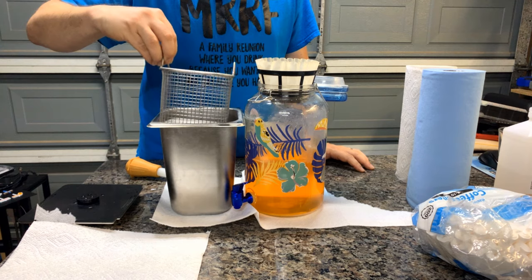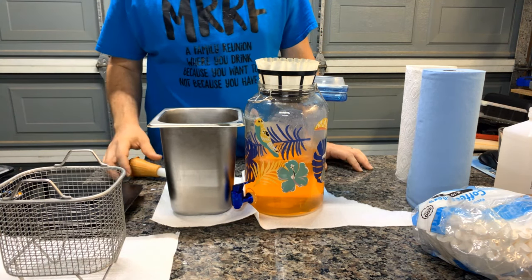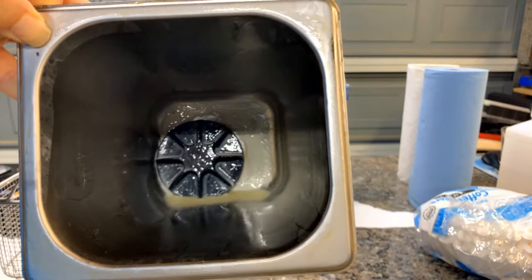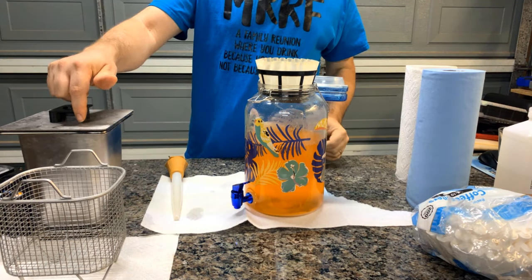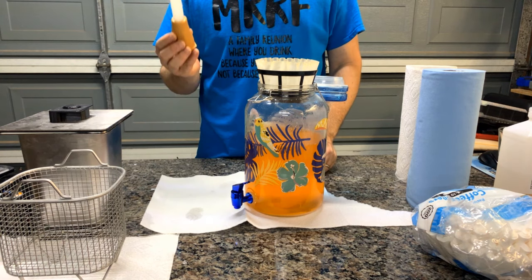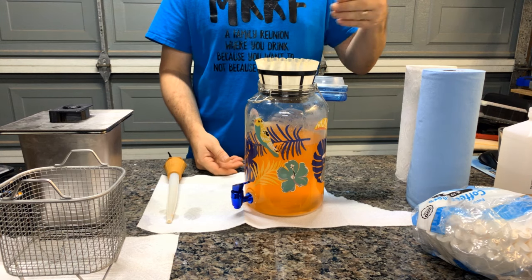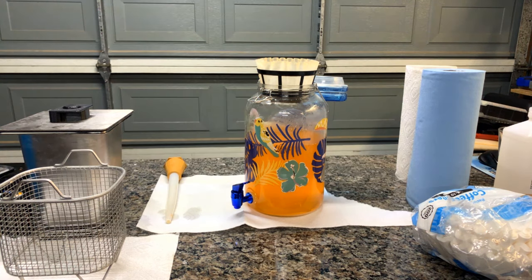I'm going to pull the basket out of here and set that aside. You can see some of the white buildup on there where it's exposed, and we're going to scrub that out and clean it later. Most of the sediment is here at the bottom. You can see the bottom of that pan — that milkiness — that is what settles to the bottom of the IPA after you've done prints for a while. We're going to take this pan and wash it, then close this up and leave it in the sun for a day or so. Once it's been in the sun, that same white powder will start to congeal and settle along the bottom. At that point we'll repeat the exact same process with the turkey baster, transfer it to another container, clean out the sediment, and go back and forth two or three times until we've filtered all of the settlement out.